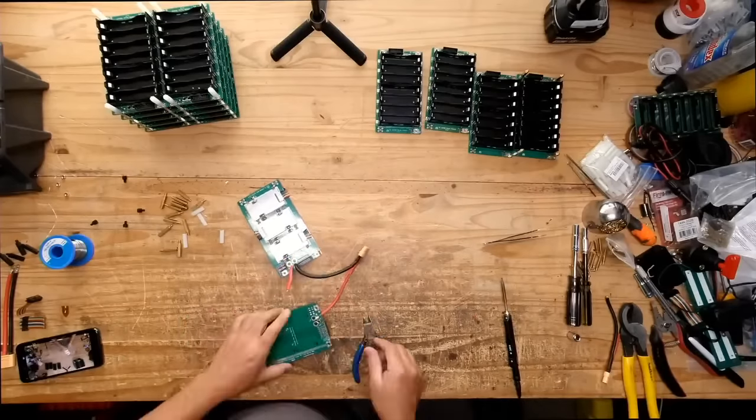Before we solder this together, we have to put it through the gland nut. But if we solder this here, then it won't get through this hole. So we have to drill the hole, put it through there, install it, and the last step is to solder this.